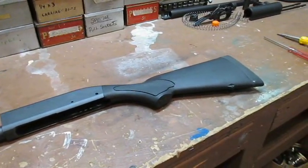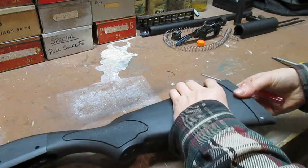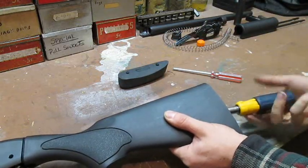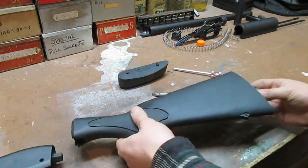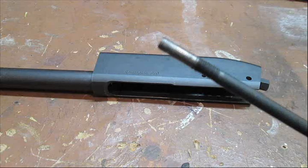The first step is to strip the receiver. Next, remove the recoil pad, then unscrew the damaged stock bolt and remove the stock. Detailed step-by-step instructions for this can be found in your owner's manual. With the stock bolt out, you can see the damage. Forcing the bolt all the way in while cross-threaded has rolled and reshaped the threads over the full length that engages the stud.